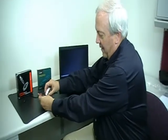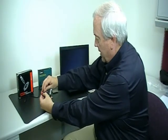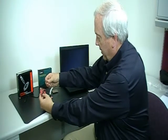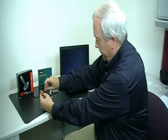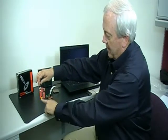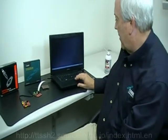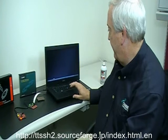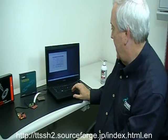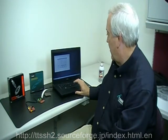We'll disconnect the flat flex cable. We need to reinstall the two jumpers that we removed so that the USB connection can work and power can come through the USB connection with this Launch Pad board. I'll now plug in the USB cable — you can see we're getting power from the computer. I'll bring up a terminal emulating program; I'm using TeraTerm right now, and I will connect it to a serial port by selecting COM15, which is the MSP430 port emulator.